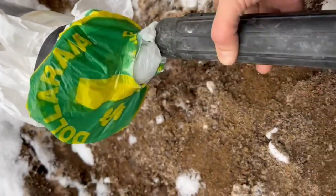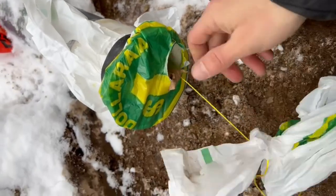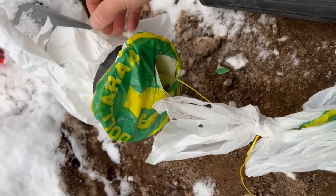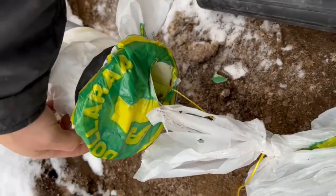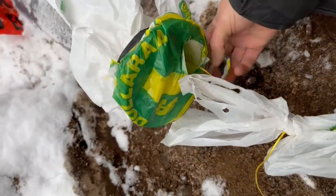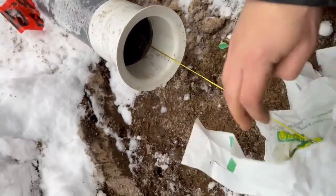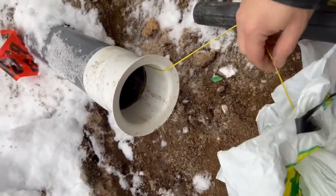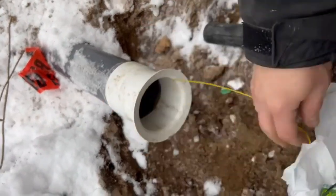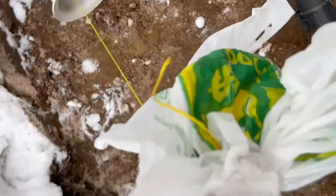As you can see, you know when it's all the way through — and there it is, super easy. Now you have the string: all you do is tie the wire to it and start pulling. That's a simple trick to get electrical wire through conduit or pipe underground very quickly. Thanks so much for watching, don't forget to subscribe. Perfect — that's how it's done.